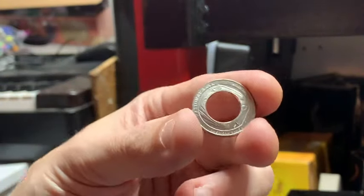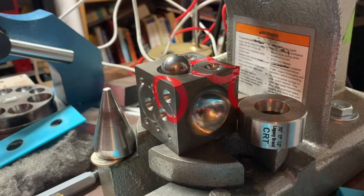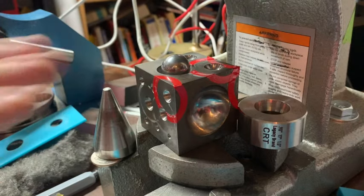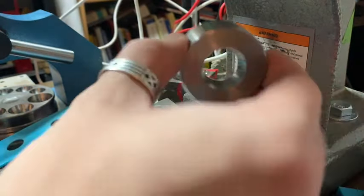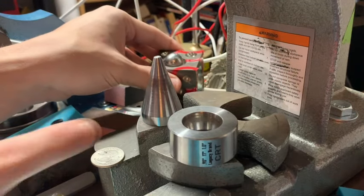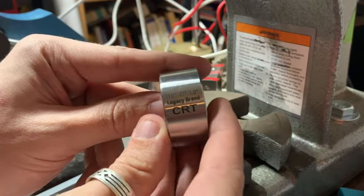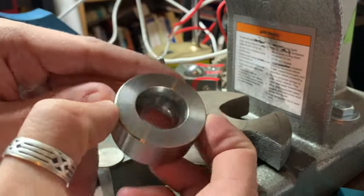Now that we've got these nice and smooth on the inside, we're moving to folding. These are my recommended tools for folding quarter coin rings. This folding ball and this doming block are not technically required but they make a world of difference. I'm going to fold first with just the two basic tools, and then after that fold with the doming block and ball to show you the difference. This is a 17-degree folding cone and a 17-degree folding die — it's 0.9 inches and one inch; I use the one-inch side to start.